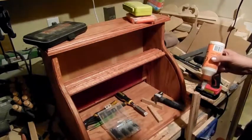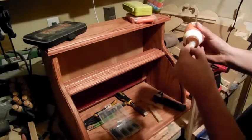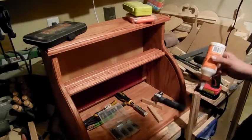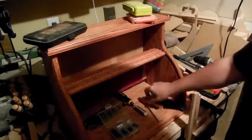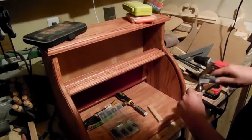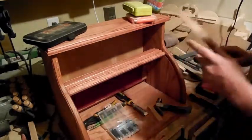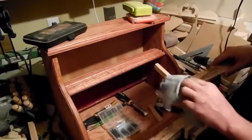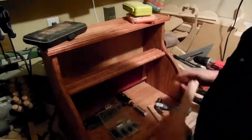It usually helps to peel off all the crusties from yesterday, the day before, the week before — whatever your last woodworking project was. Get a nice coating of glue on that, put it in place, and nail her down snug. I'm not worried about that coming out, because that nail is going to be between the bread box and the runner. So it doesn't even have to be all that tight — that's just ensuring it holds. Time for number two.